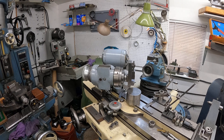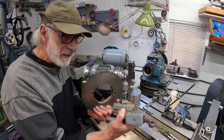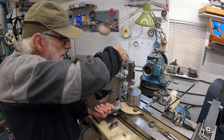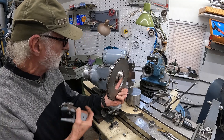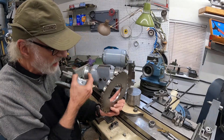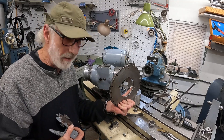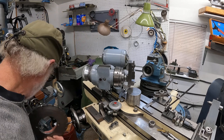You can index with this head using a 24-space indexing ring that bolts onto the head. You can grind a hex into a carbide shank if you're so inclined.